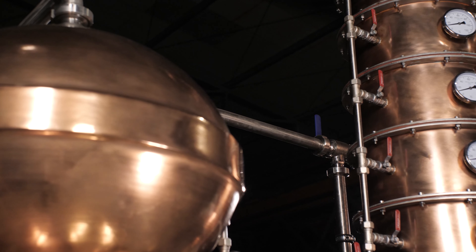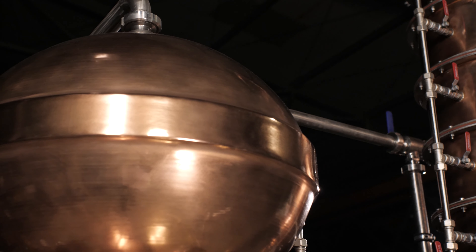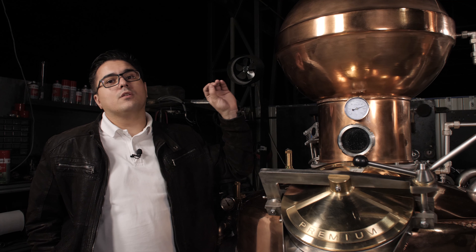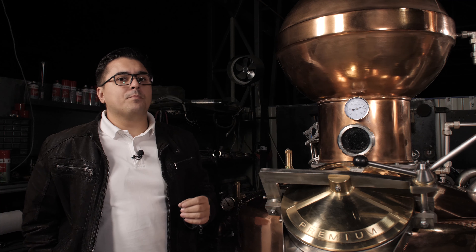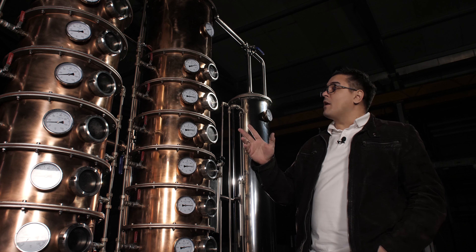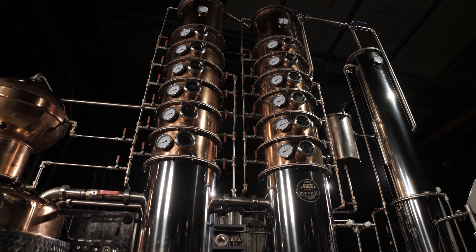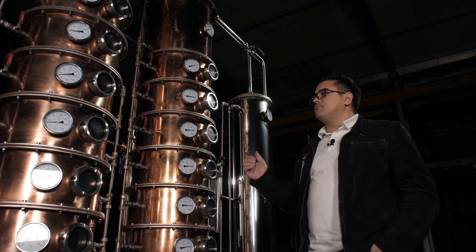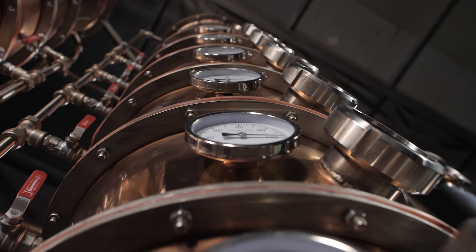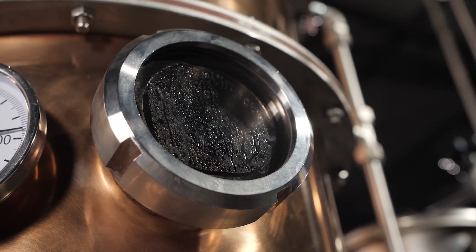The pot is manufactured from pure electrolytic copper. Inside, the mash is stirred by mixer blades which are positioned diagonally. Mixing is powered by an electric motor that runs at 96 rpm. It achieves good circulation of the mash, providing constant contact with the hot surface on the inside and equally heating the entire mass, ensuring very efficient extraction of alcoholic vapors from the mash. The upper part of the cap provides a large surface and volume for vapors to interact with the copper and condense, providing a very good initial reflux.